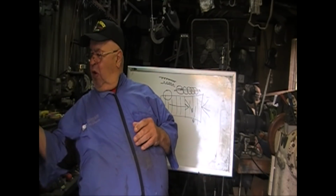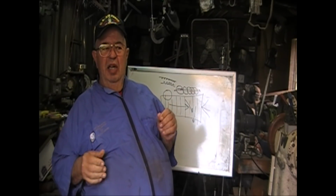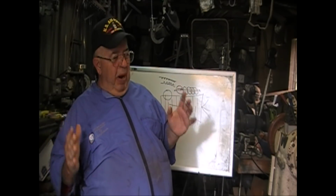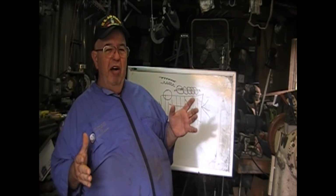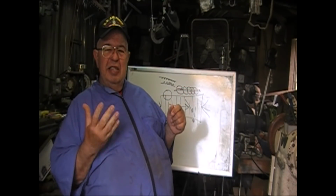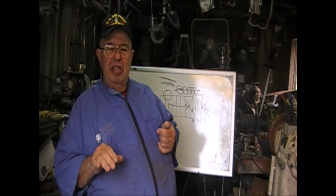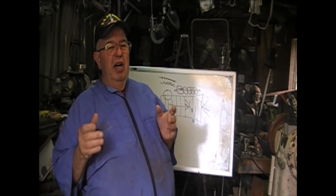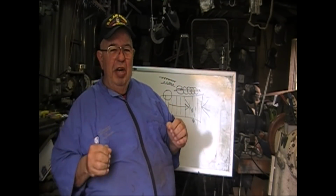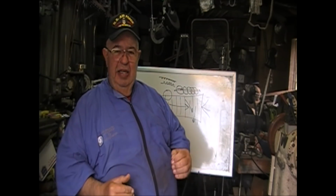So I'm not telling you to throw away your strip paper. I'm telling you to augment it with a disc. Augment your disc from 80 to 400. And then if you think you need to polish this lumber or plastic or whatever, you can step up to the abrasive pads and discs and all that stuff and buff it all out. You can do that with the lathe stopped. That's nice. But keep this in mind, woodturners. The quality of the work you're going to see is the work you put in.